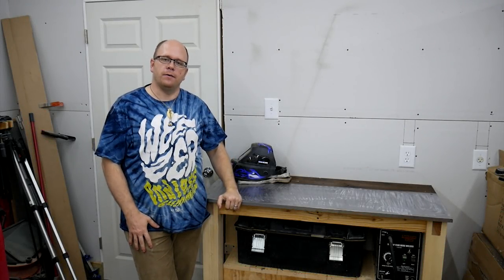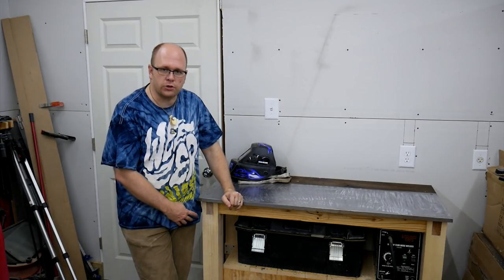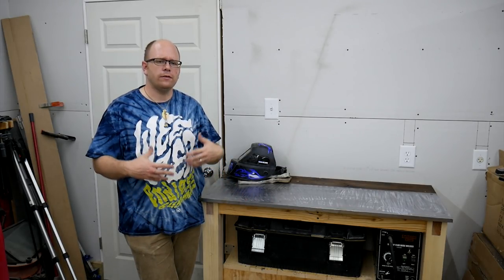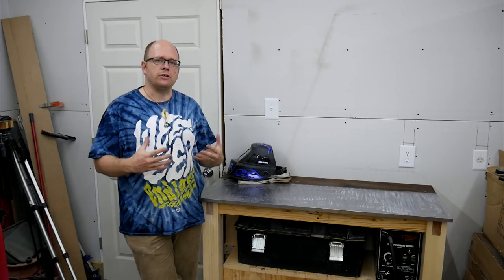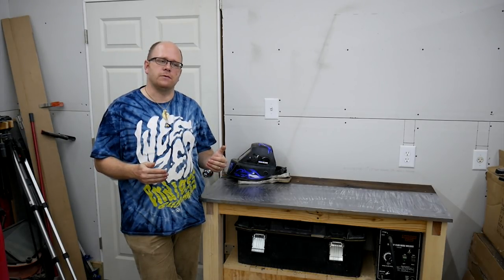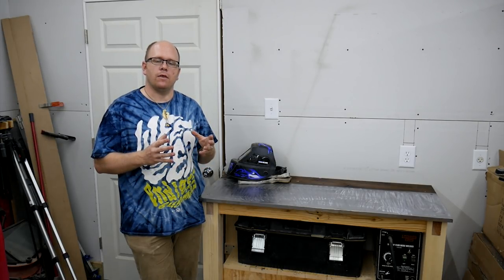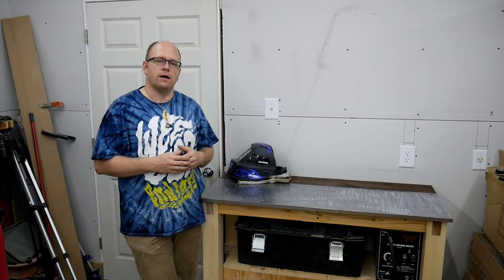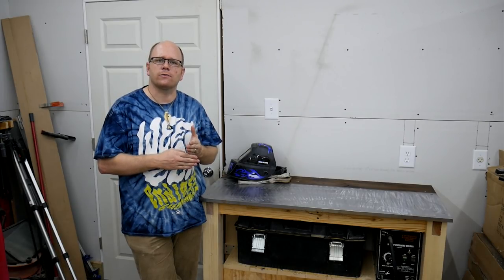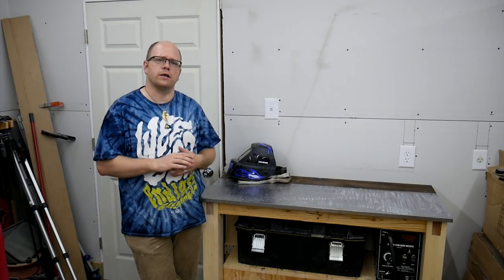Hey everybody, welcome back to the shop. My name is Tom. In my other video I showed how I built this welding table. In this video I'd like to focus a little bit more on the way that I joined the sides to the legs. Out on the internet, whenever you see some type of joint that is not conventional, people tend to name it a Japanese joint or Japanese joinery. I'm not 100% sure that this is Japanese by nature. I've seen it called many different names — a double tongue and groove, a double half lap joint. It kind of combines a lot of different joinery techniques: it combines a mortise and tenon with a half lap joint, but it also has a groove system that interlocks with itself. I'm going to spend the time in this video explaining how I put this joint together, and then at the end we'll discuss whether or not it's worth it.